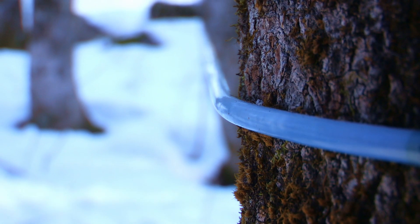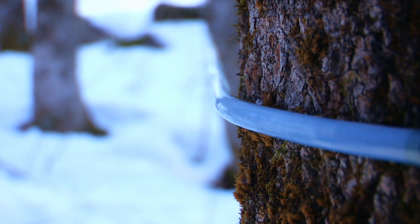The other principle is that in a 5/16" tubing, if you don't get a big run and you don't have a lot of sap, the sap and the air can separate. So in some cases, at the start of a run for example, you may lose your vacuum — when the air goes above, you drop the sap. That's impossible with the 3/16" tubing because of the surface tension of sap. The tubing being smaller, water and air simply cannot separate inside. You're going to see drops of air and drops of sap come down the tubing side by side, and even the air compresses a little on the way down. This is a big advantage of 3/16" over 5/16" tubing.